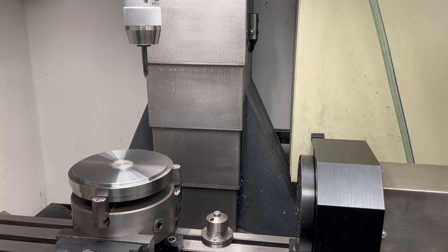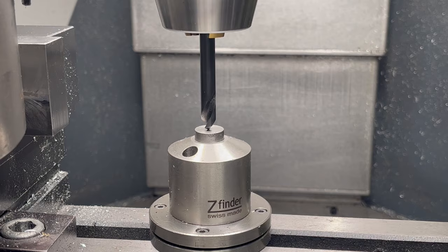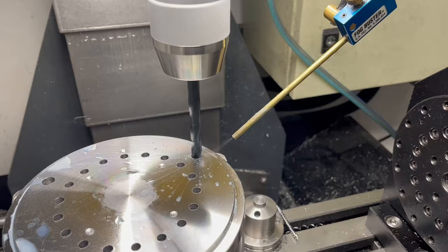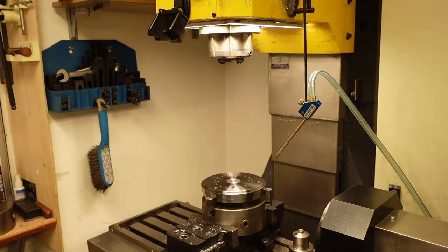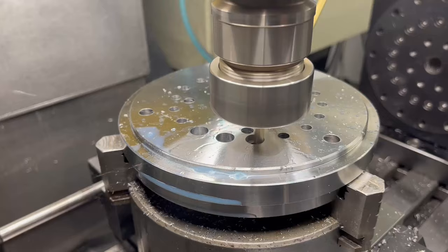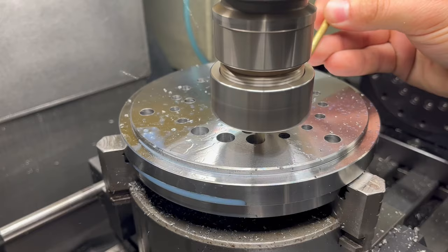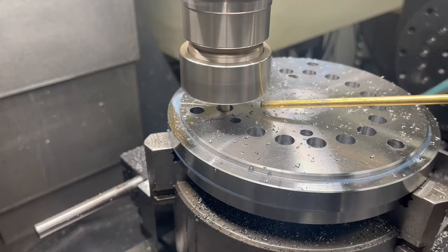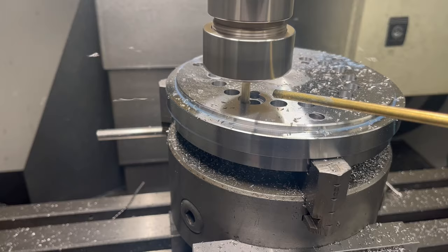It's time for some spot drilling. Another useful feature on this mill is the tool length probe, which automatically sets the tool length offset in LinuxCNC. With the feature holes spotted, I can now proceed with drilling the holes for the mounting screws, then the hole for the 3-jaw chuck, then the holes for the pins that will constrain the vise. This 6mm end mill will do the counterbore for the head screws. Luckily these are not blind holes, so chips can fall down — otherwise cutting these deep small-diameter bores without coolant leads to serious chip recutting and maybe even tool breakage.